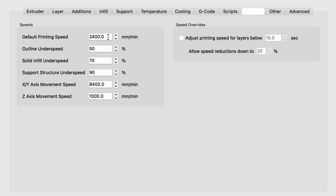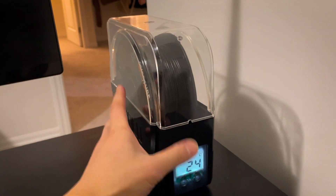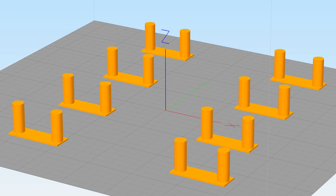During the experiment I found my printer wasn't capable of pushing faster, because the nozzle couldn't keep up with the extrusion rate for PETG beyond 40mm/s. The indicator was clicking in the extruder. One key thing I know people will ask: yes, I did dry my filament — 24 hours for the Overture filament previously, plus another 6 hours mid-experiment.